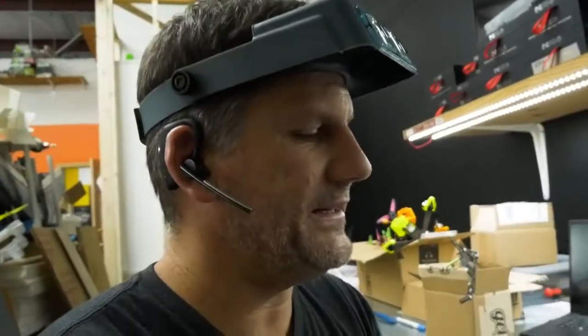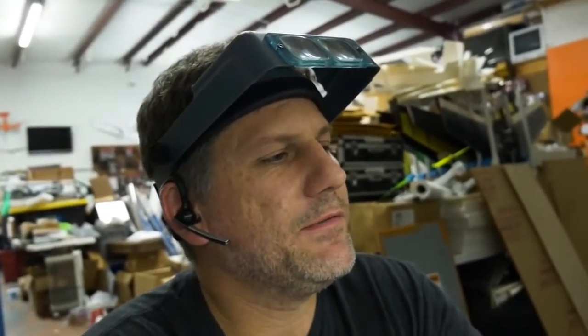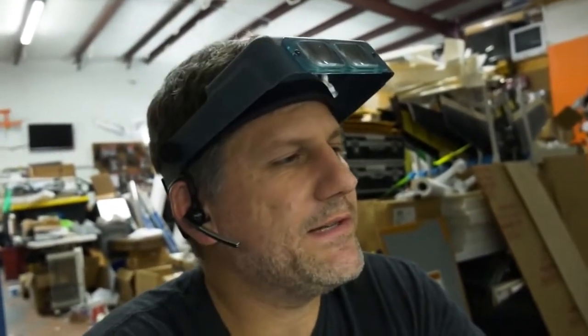I got these electromagnets off of Amazon. They're 24 volts, which will run perfect on 6S. According to the specs, they have the ability to lift 15 kilograms of weight each. And I'm gonna be running four on this quad, one on each arm. It's over 100 pounds of lifting power that these electromagnets are supposed to be able to lift.